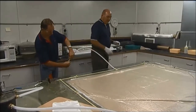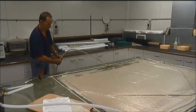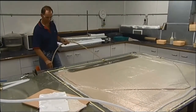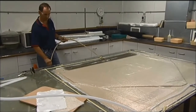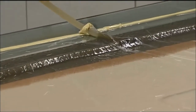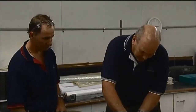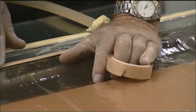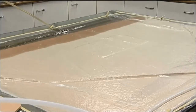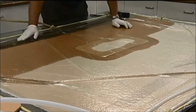Once the materials are placed in position and covered with the sheet and sealed, the vacuum is drawn between the moulding plate and the cover membrane with controlled pressure. Upon achieving proper vacuum, resin is supplied to the infusion system, drawn in by the vacuum. It is critical to ensure the resin moves evenly through the reinforcement, displacing air as it does so — resin movement should be even to prevent pockets of dry glass. Any vacuum leaks should be corrected. A high level of vacuum is necessary and should be maintained for a long period of time. The resin is allowed to totally infuse the reinforcement, then the resin supply is shut off, but the vacuum is maintained until the resin has cured.